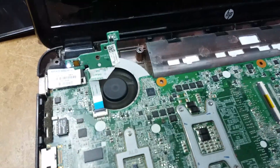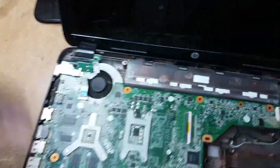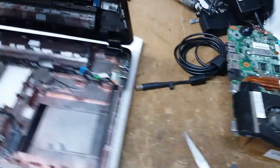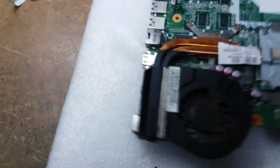You can see the light goes on and no picture, fans on, it's pretty dirty. So now you've got basically four options: you can either do a reflow on the graphics chip — that'll probably work for around two weeks, maybe three months if you're lucky. You can also order a new graphics chip, but that will probably be as expensive as a new board. That's your third option — get a new board. Then you've got a fourth option.